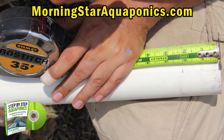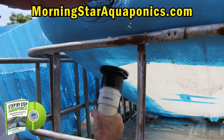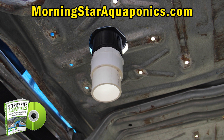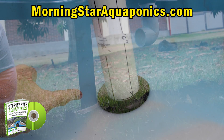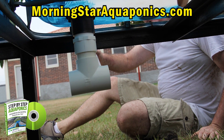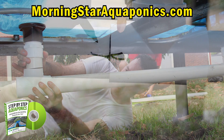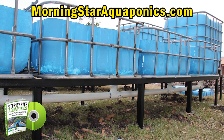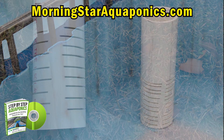Now it's time to start putting some PVC pipe in. As you can tell, we're making the PVC connections below through the bulkhead connectors. This is a standpipe that I'm showing you here, with further connections down below to tie all the plumbing in together. It's very important that you measure and cut this properly. As you can see, the plumbing has been plumbed below the actual grow beds. This is a four-inch sleeve that I put over the standpipe to ensure that no debris will enter the standpipe area.